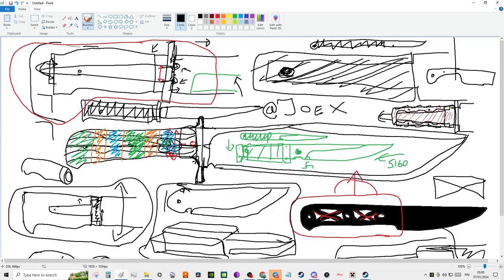But yeah, you want to avoid putting a second pin in this kind of construction. You want to have one. But there is a chance that you will see a split occur down the middle there, especially if you use brass and metal and stuff like that. But it's also what you'll often find with pins like this is that as the knife ages, the pins start to pop out from the material. They do this kind of thing, and then you have a sharp corner, because the wood shrinks, and it's not comfortable. It can actually kind of cut into your hand.